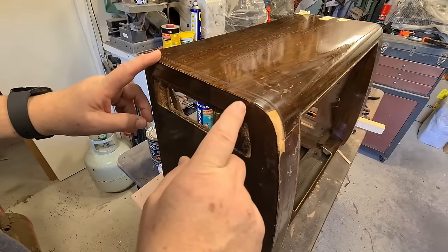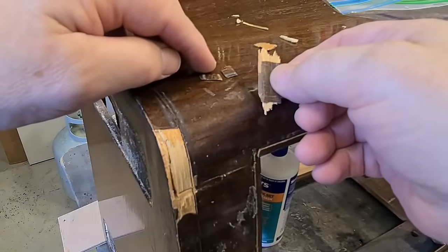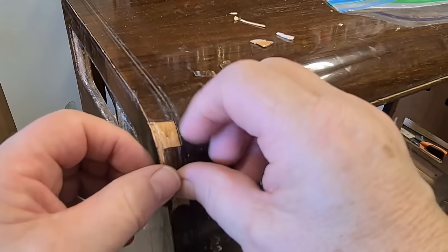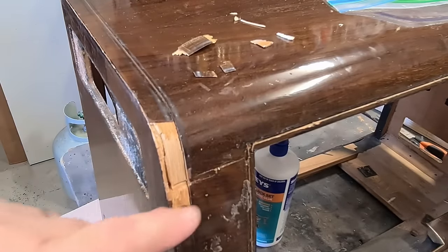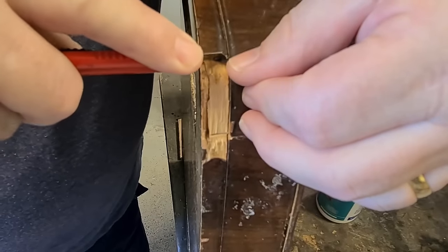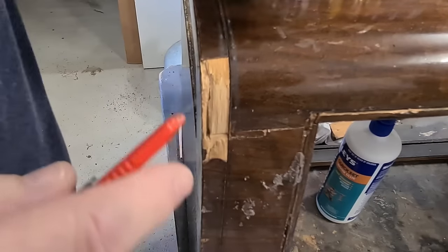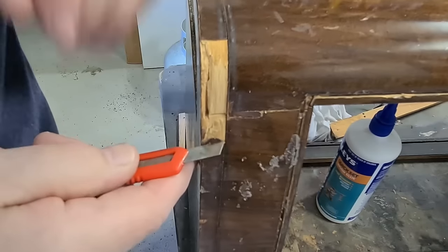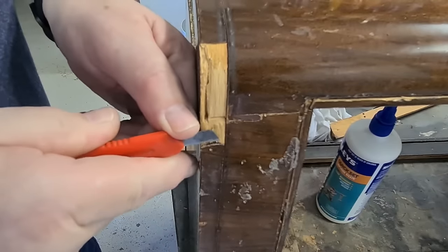I've taken the clamps off - I left it overnight; I thought it might be safer. I'll try and find the little bits of missing veneer and see if they can be glued back on. These are the little bits of veneer that came out and I don't think I can do anything with them. It would be like a jigsaw puzzle and a piece is missing. So I'll just cut that off square with the grain - the grain's running across anyway so it'll look alright - and then I'll put some new veneer over it. I'll cut both pieces of veneer at once.